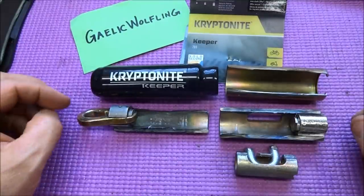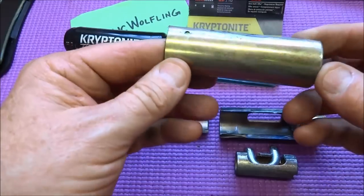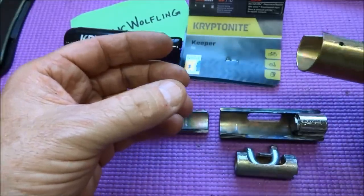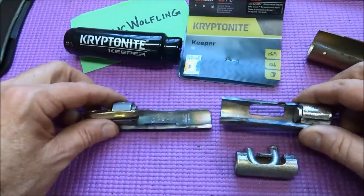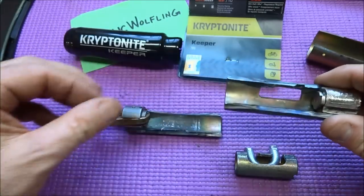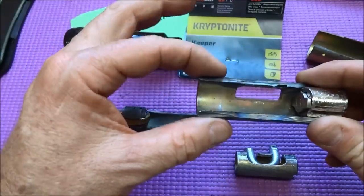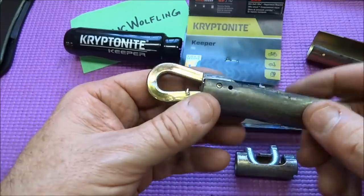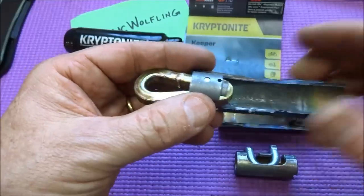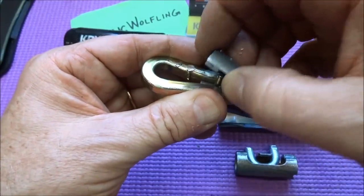What an ordeal. The first thing we did was cut the cover off — that was the right decision, because it exposed the outer sleeve. When we punched that pin, miraculously the outer sleeve came off and exposed the heavy steel inner case. All of this is hardened steel — not lightly hardened either, this is seriously hardened steel. It exposed a quarter-inch-thick housing. We tried attacking this to release the link, tried driving in the pin, but the other side of the housing prevented the pin from coming out.